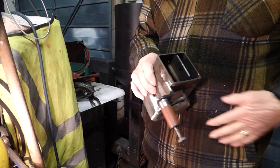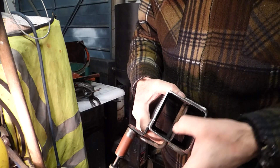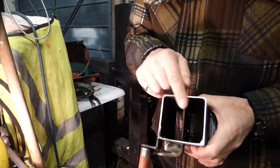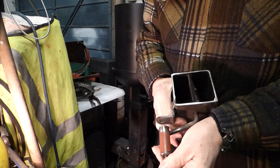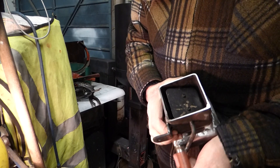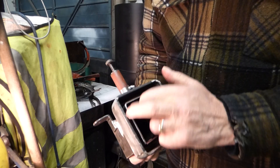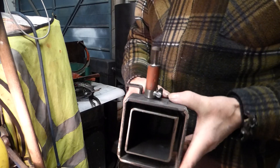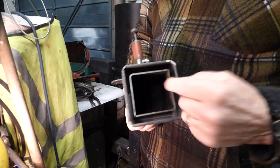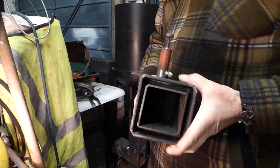The little modification that I did make on the butterfly — I don't know if you'll be able to see it — I've put a chamfer on there, so when it shuts, if there's any pellets inside, it will actually chop the pellets that are in the way. That bit there fits on the top, all the way round, and that seals on the top of the fire — you don't need any air going in there at all. So that fits on the 4 inch, because mine's 4 inch.